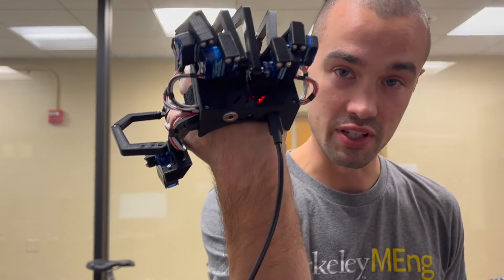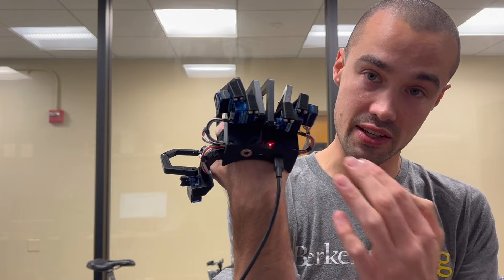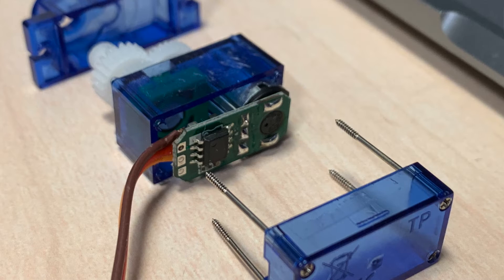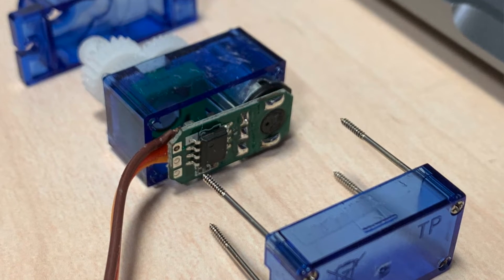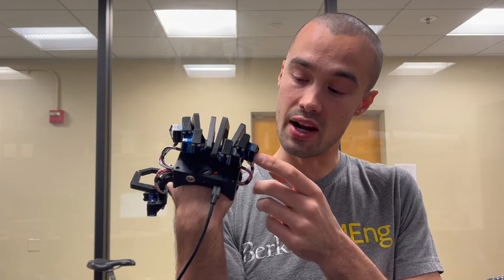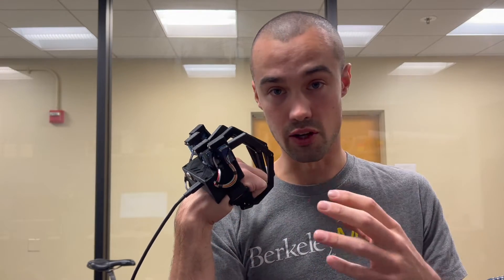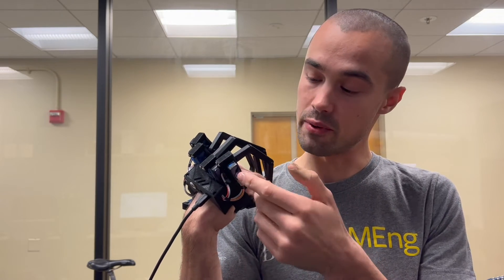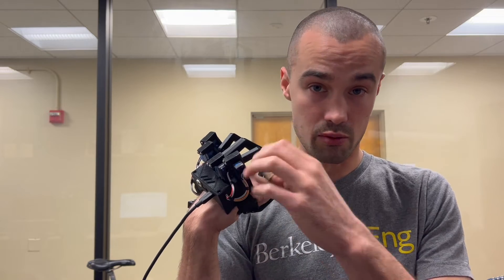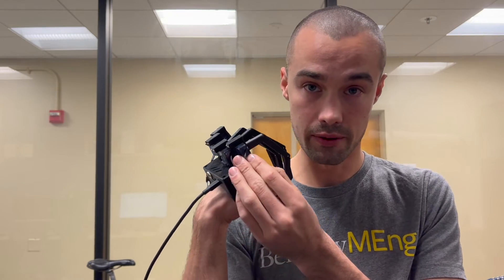The servos I'm using in this project have been upgraded so my microcontroller can have direct access to the H-Bridge motor driver. I'm also running the signals from the encoder out to the microcontroller as well, and I'm making an upgrade — a little PCB with the motor driver on it. So if you want to do this upgrade, you can take apart pretty much any servo, just remove the electronics that are there, and solder in my upgraded board. I'll make all these design files available for free online as well.